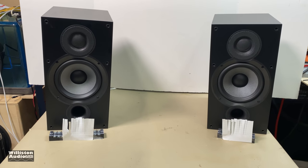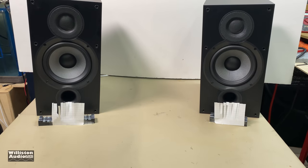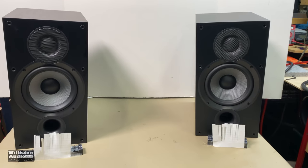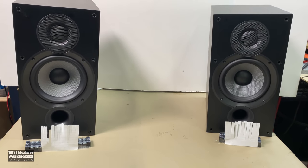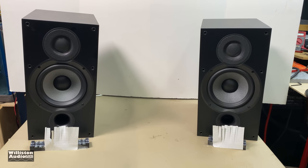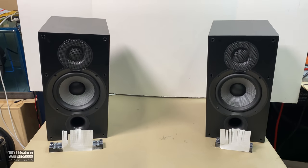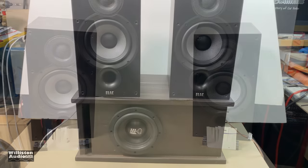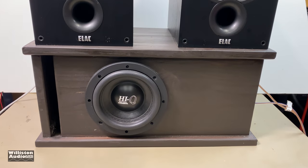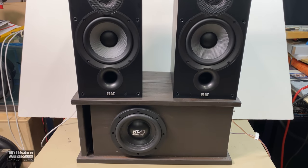I don't have the bass boost on at all, but it does seem to be overemphasizing the bass a little bit. It was making stuff on the wall rattle at a certain frequency — I had a ladder over there rattling — but overall it sounds pretty good, just a little heavy on the bass end. I'm going to hook up a subwoofer to the rear channels and leave the front channels connected to the bookshelf speakers. The sub is set at 4 ohms and bridged on the rear channels of the RX4.